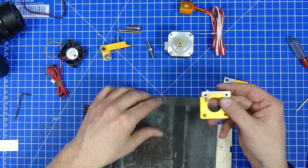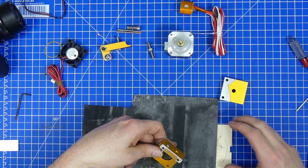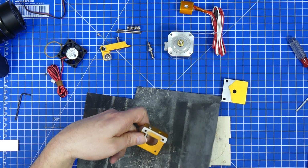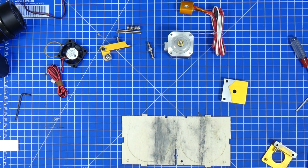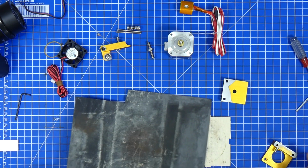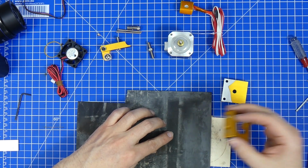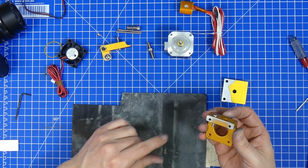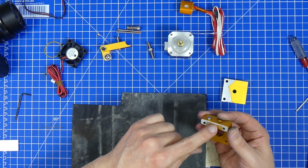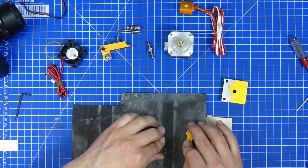If you ever get the feeling that the aluminium is not running smoothly over your sandpaper, this is a 1000 grain sandpaper, I believe. Let's have a look. Right. No, this here is a 400 grain sandpaper. And if it's not running over that well, just move to a different spot and continue from there, because you don't want to have any big grains under there. And you can also just gently clean that off and start over.